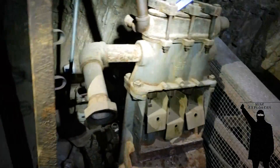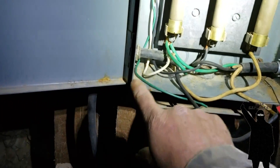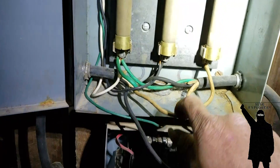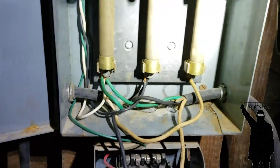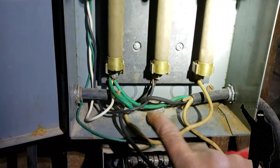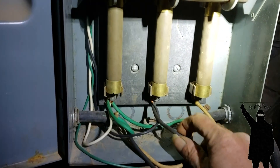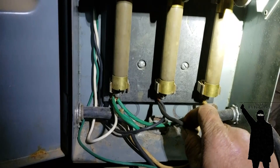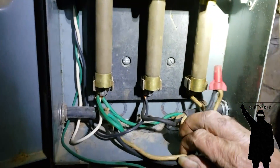This line here — does this go to the motor? That goes to the pump motor. So this is the line from the pump switch. This is neutral right here — neutral from the pump switch connects to a fuse, then neutral going to the motor. The pump switch is just in series with the motor: line goes directly to the motor, neutral goes to the pump switch, the other wire from the pump switch comes back to the motor.